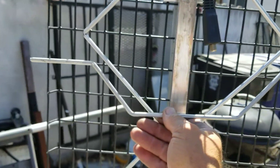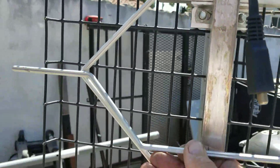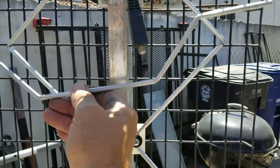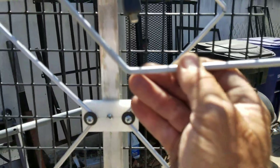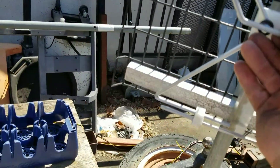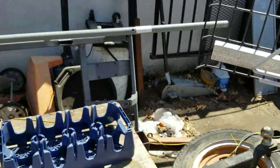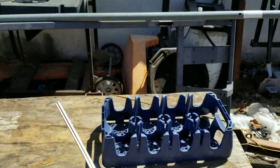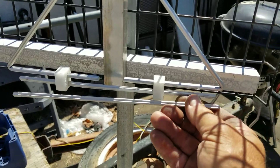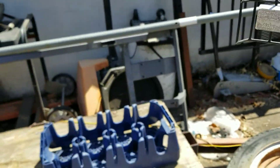On my first one I used these little hat designs — basically it's half of one of those diamonds, so I came down three inches here, three inches there, and three inches across. If you wanted to make this you don't really have to; I found it's just a waste of time, just a fancy design that doesn't really do much. These little straight rods are what I used on this one, and I get just as good reception out of this antenna as I do out of the bigger one, so you can save some material by building a smaller one.